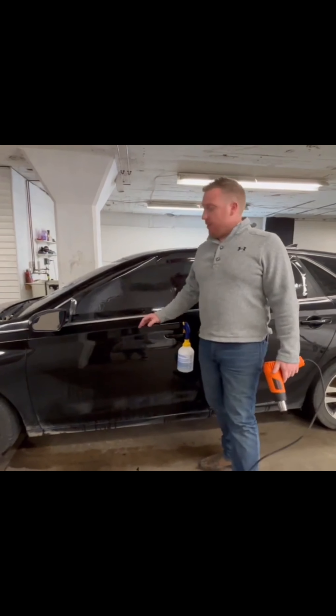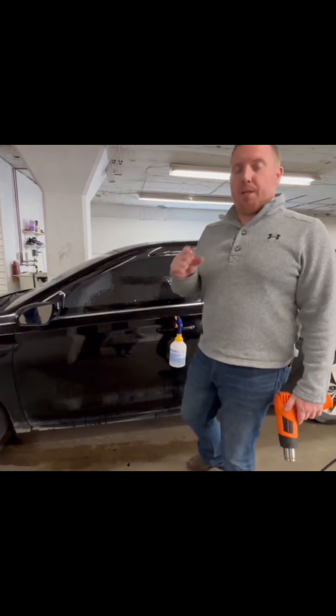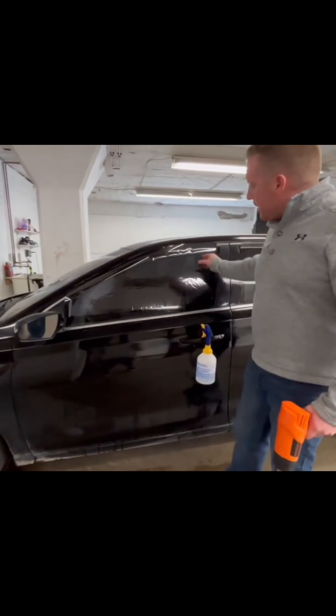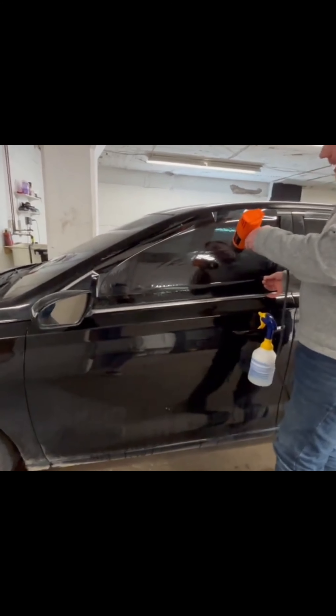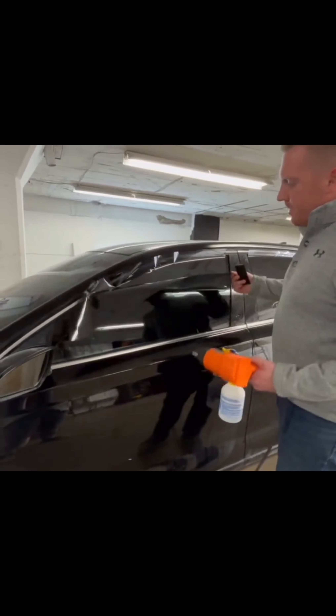Take the heat gun three seconds about an inch off the glass and then push down. The secret is you need about 1100 degrees Fahrenheit to get rid of these fingers. The angle of the heat gun is very important — don't come up or you can burn the film; stay over top about a half inch off. Go slowly on the bottom of the film. Once done, spray it down, spray underneath the film, create the N again, and push all that slip solution out. In our courses we always suggest shrinking twice to make sure the fingers don't pop up.